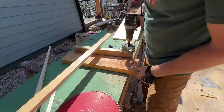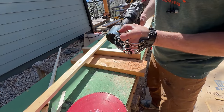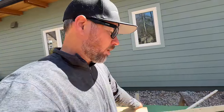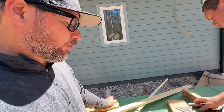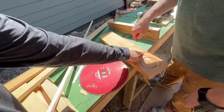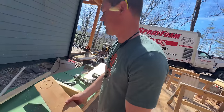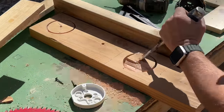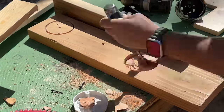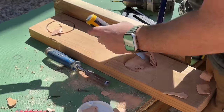See how deep we're getting — that might be enough. I was going to use this as a gauge. It's about a half inch. If you ever have to drill a big hole like that, it's a good idea to drill it before you cut a little puck off the end — because you'd have to hold on to that while you drill it. It's insane — a little bit of a wild ride there.